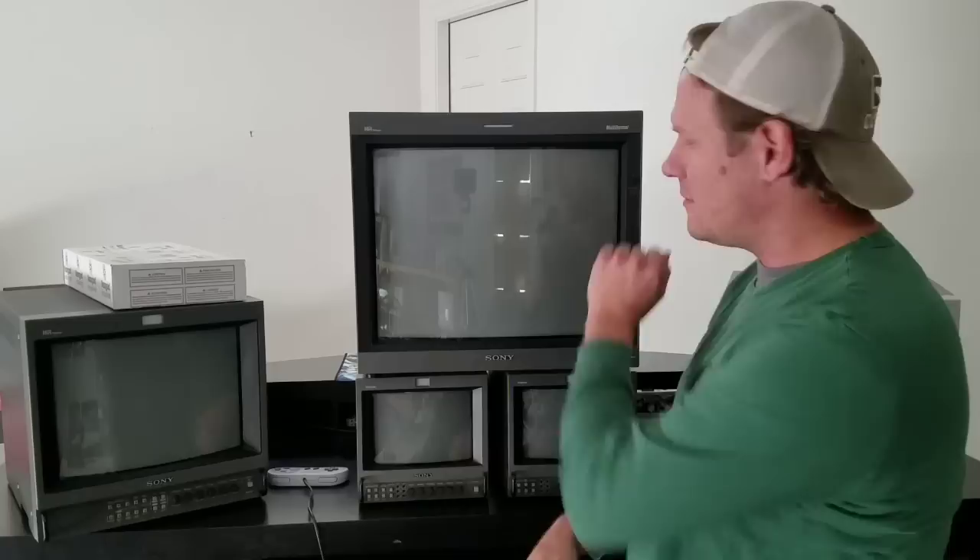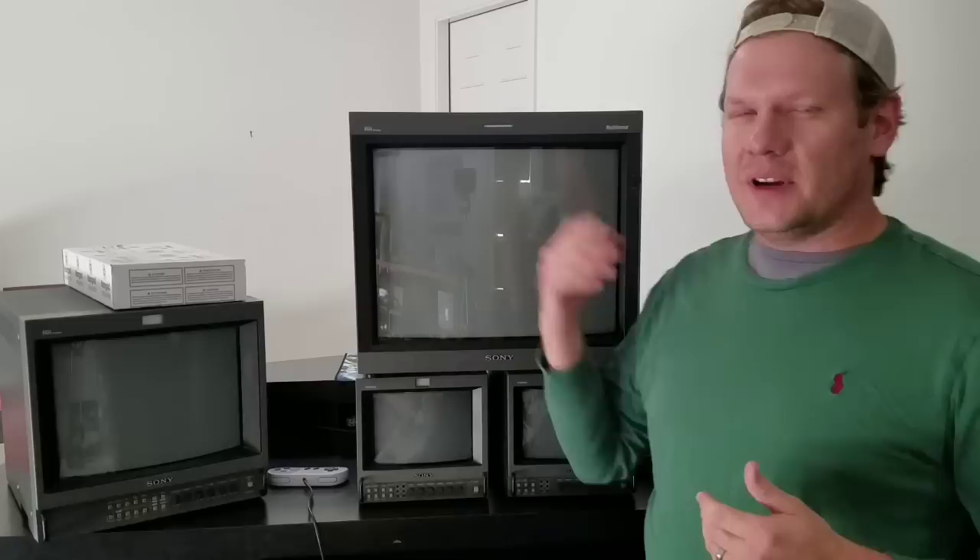So what else should we be mindful of? If this is your first time working on a CRT, never do it while it's running. Go ahead and make sure it's been powered off for at least one day, maybe two or three, just to be safe. If you have a monitor like the ones back here, they have power buttons you can push in while it's not plugged in — let it sit like that and hopefully it will discharge most electricity over time. The time these things have the most electricity is when they're running and right after they're done. They still have a lot of electrons and electrical current built up inside the tube, which is one of the most dangerous parts.